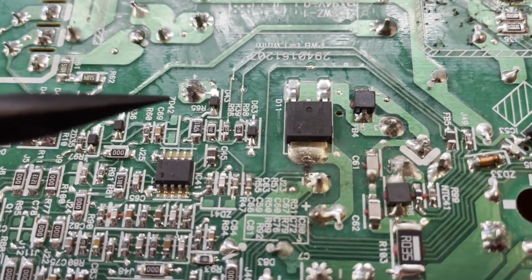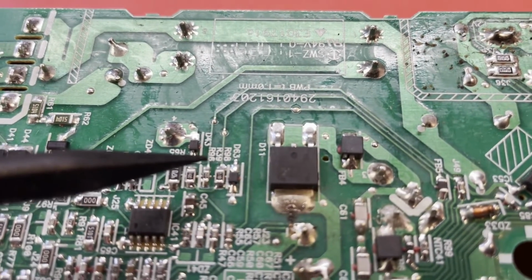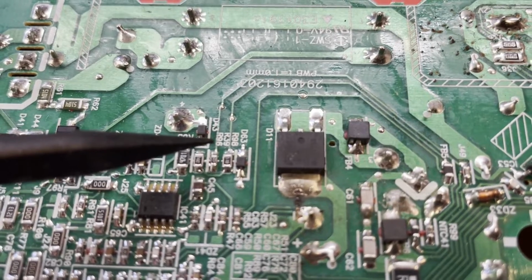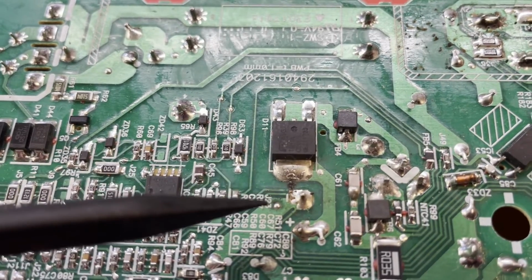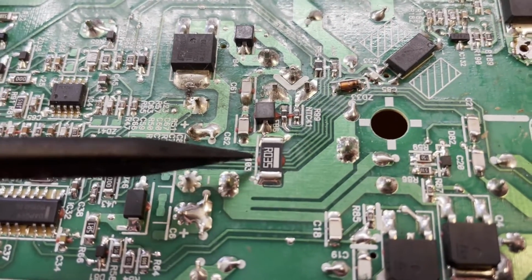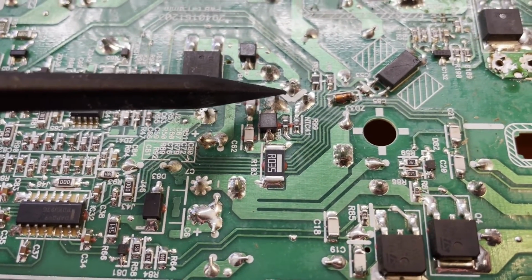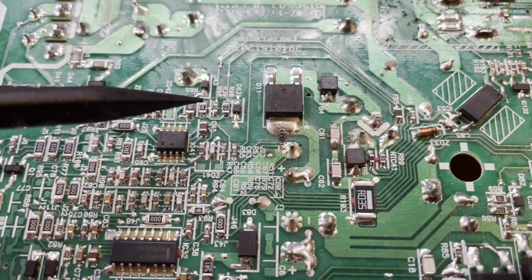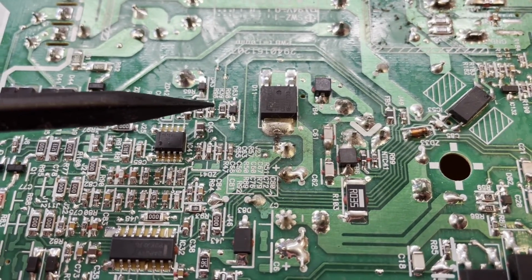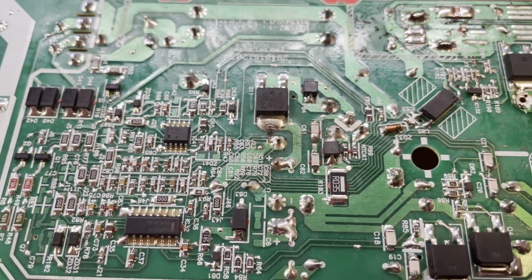But if we look on this other board, this donor board, which is a slightly different model, it has that exact same layout, looks like, on those resistors. Exact same numbering. R96, R39, D63. They're in that same position, same order. And here's our current sampling resistor. So we may have all the parts we need right here. I'm not sure about the MOSFET, but I'll check it. At the very least, we now know what our component values are. Looks like it was 4.7K and a 10 ohm on the other one. So at least now we know.